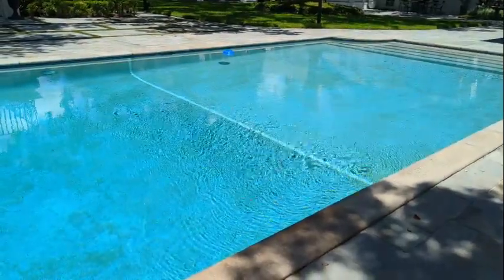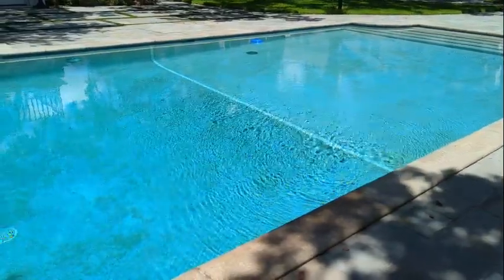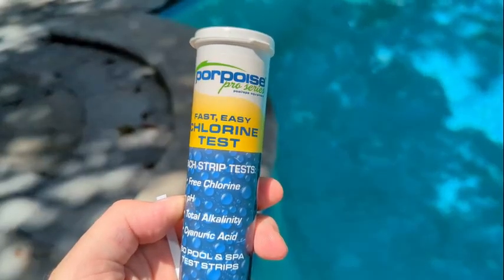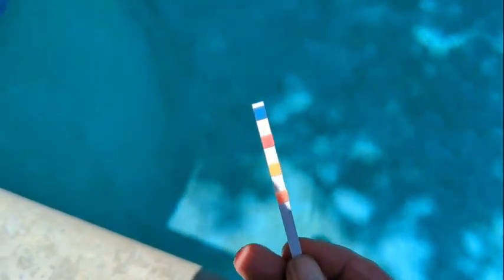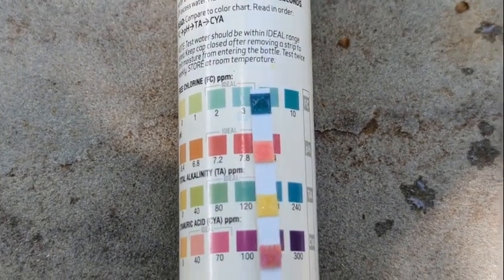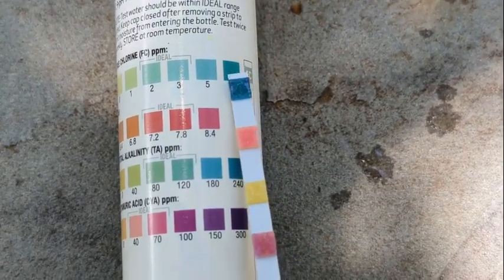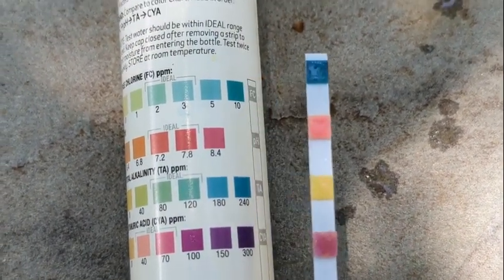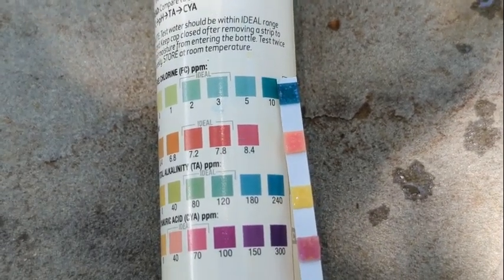What I want to show you is something that happens to a lot of people. I'm going to take the chemical readings right now. I'm going to take my test strip, just dip it down in there and come up very slowly. Look at that — the top one is the chlorine. We can see just how high the chlorine is. That is way over — that's 10 right here, which is really dark. The strip is even darker than that, which means the chlorine is extremely high.